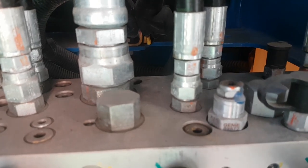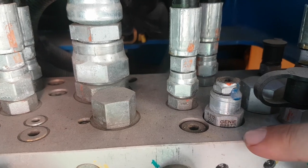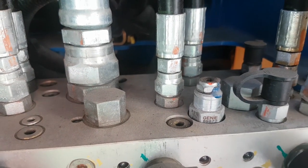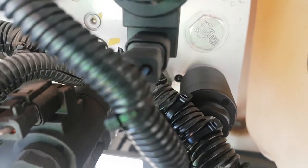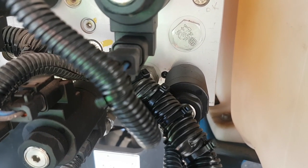As we get closer to these valves you can see there is a part number on the valve itself. This is the critical part in identifying what the valve is and how to get information on it. On the Sun unit it's on the side, and on the other one down here the part number is stamped on top of the valve itself.